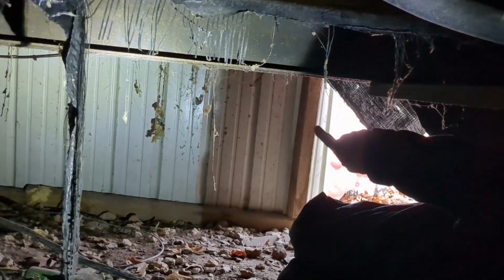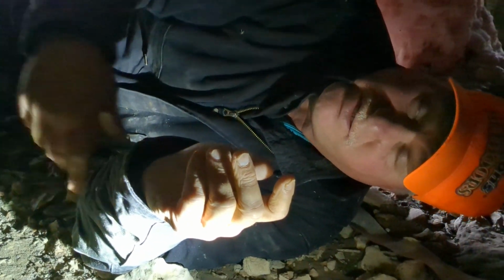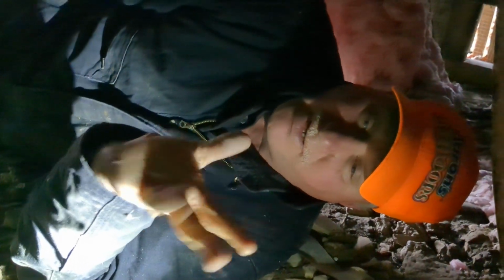The frames are usually about 3 foot from the outside wall, the main frames. Although this carries a lot of the weight, if that outside 2x6 that supports all these, or 2x10 or 2x8, is rotted, this frame will not carry the weight of the house. It'll end up bending. The tongue will drag, which is on this end, and the back end will drag on the other side of the axles. So it's very important to maintain the siding of your house, because these frames are not enough by themselves to carry the weight, one on each side, about 8 foot apart. All right, that's me running on.